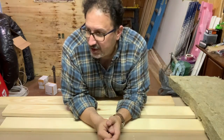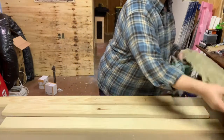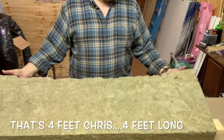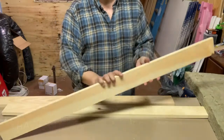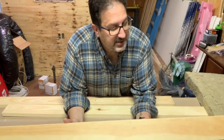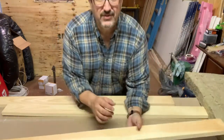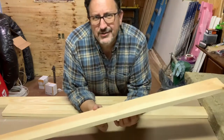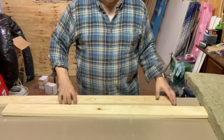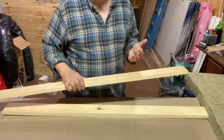I figure I have some extra wood and I could buy the stuff to make it pretty cheaply. Here's the insulation we need: the Safe and Sound rock wool. This is one batten and it's three inches thick, four feet long. Coincidentally, they have one-by-threes — not exactly one-by-three, but three inches in depth and four feet long — the exact length I need to match the batten width. I have two of these, about three dollars and fifty cents a board at Lowe's. For the ends I have to cut them at 15 and a quarter inches.